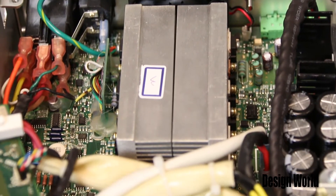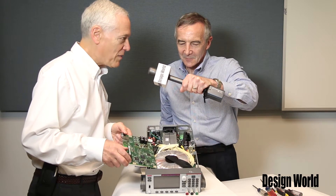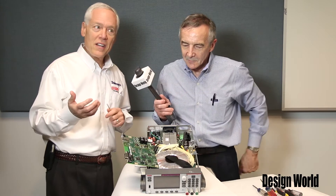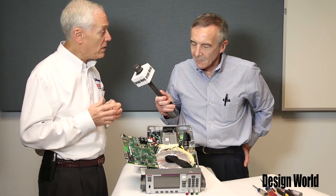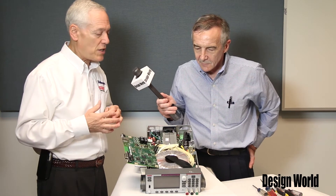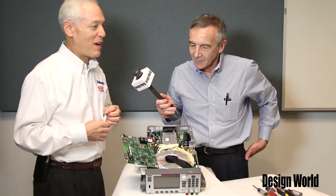Let's pop the cover off this guy and take a look at where the magic is. We've got the cover off the instrument. Bob, maybe the place to start is this big honking toroid here. What exactly is that? Well, that's the main input power transformer. The unit can operate anywhere from 90 volts up to 260 volts so that it can be universally powered anywhere in the world. We chose to use a toroid instead of a more typical E-shaped transformer because toroids are very power efficient. We're trying to measure low current as much as we could, so we wanted our box to be as cool as possible, and we felt the toroid would help us achieve that goal. It's a linear power supply and all linear power supplies need a large iron transformer in some form.